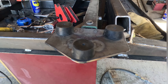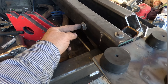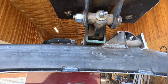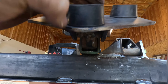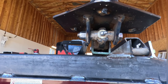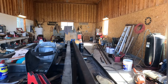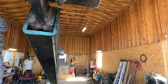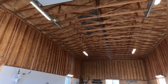Here's the final product on this foot — got the adjustment bolt for up and down, got the pivot bolt back in here, got a grease zerk, and this bolt so it pivots. It's nice and snug. So that foot will sit on the floor, and as this comes up it can pivot back and stay level. That's the foot.